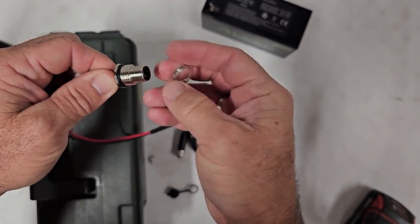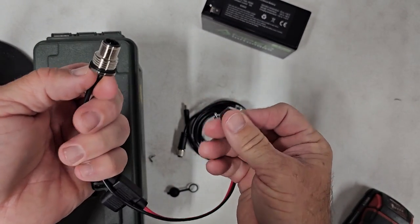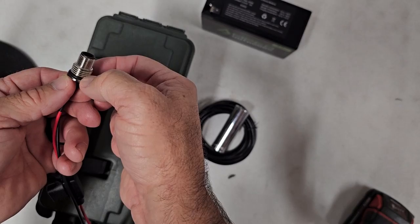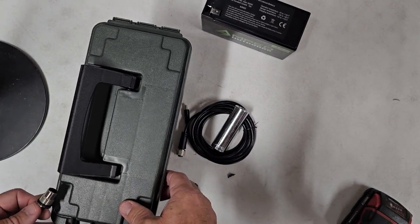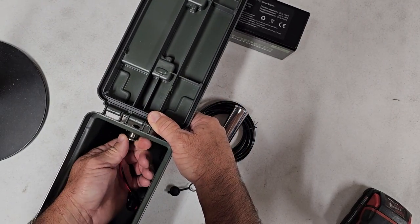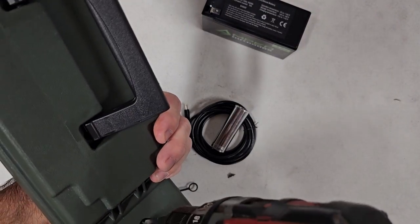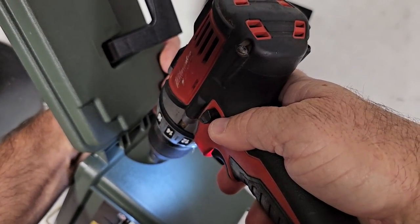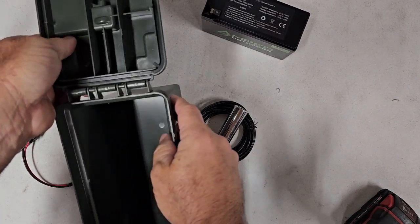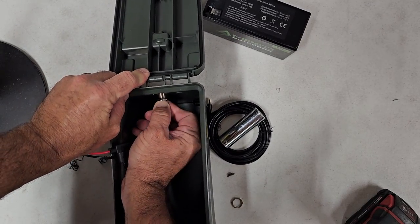There's an O-ring on here. The O-ring fits into this groove — that O-ring goes on the inside of your box, and your nut goes on the outside. You've got a two-piece threaded part here; this part is for your cable. Let's see how that fits in there. Don't take too much — you want that O-ring to be able to seal up really nice.